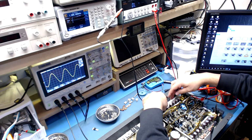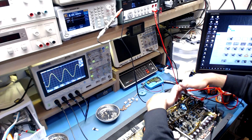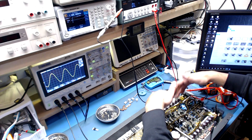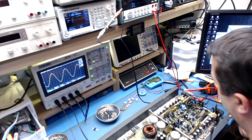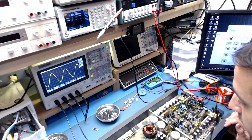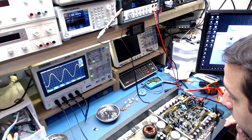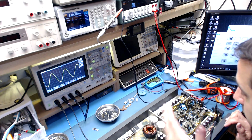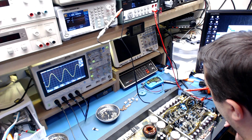You can tell that they're all pretty much, all the drains are connected. A lot of the parts are connected together. The gates are all the same drive for the N side and the P side. That's where it splits off, but other than that, everything else is the same. So I'd feel confident putting one part in each side and testing it. This is great. We haven't even dug out the service manual on this yet because we haven't had to. I think it's been pretty self-explanatory, the problems with this as things have been unfolding. So I'm not too concerned yet.